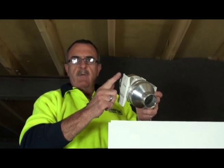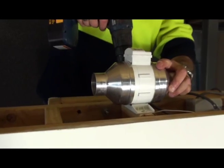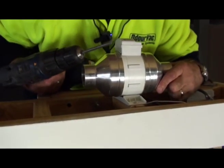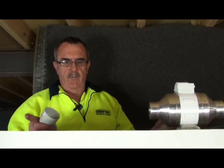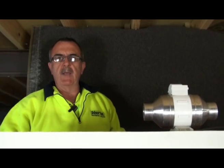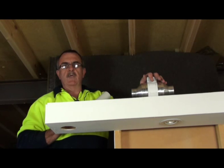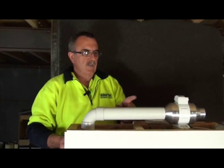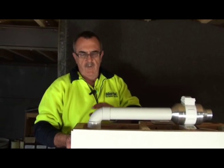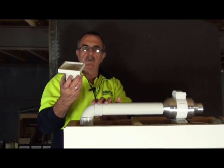Once you've done that, you can mount it with the bracket supplied on the base of the fan, which also allows you to move it to the side if you want to by just pulling the bracket off and sliding it on. Then we position it and screw it into the timber cavity of your roof. Once you've determined where your fan is and you've mounted it, use the most direct route possible for the PVC fittings. If you have to put any bends in, always use two 45s to assist in the airflow. You need to cut a length of 50mm pipe, which is not supplied in your kit, and place it on the fan with duct tape, facing the exit of the eave. After you've installed the 50mm pipe, you need to put a 50 by 90 bend with a small amount of 50mm PVC pipe, enough to exit the eave to determine where your outside grill is going.